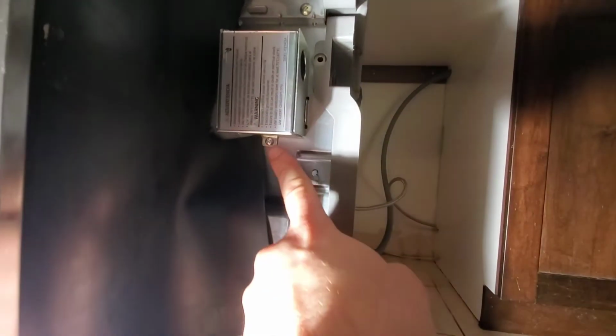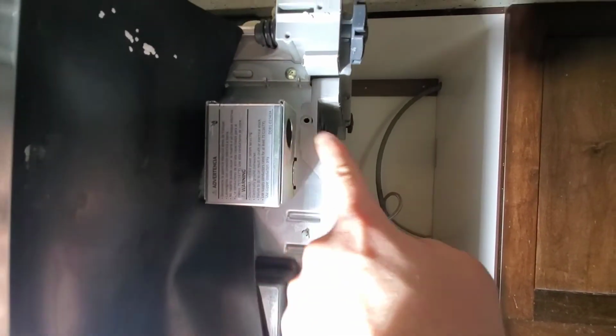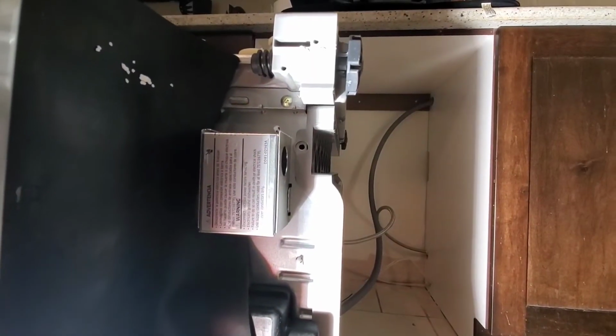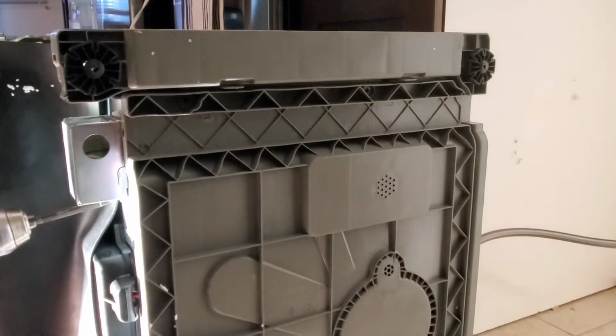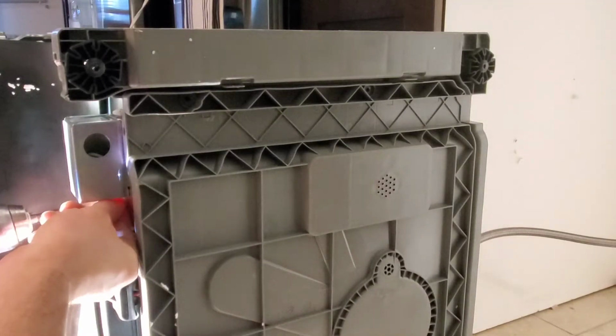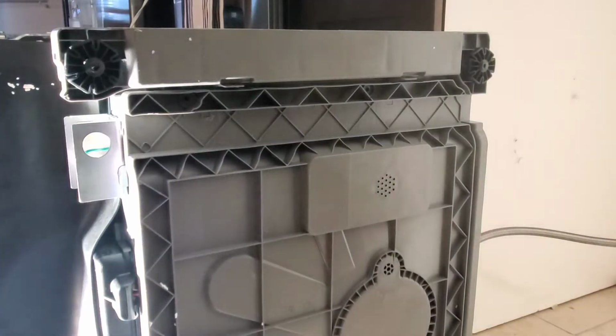So this is the power box on the new unit. There's a screw to the left. The hole is where the grommet will go. The channel is where the wire is going to go from the back of the unit to the very front. So I'm removing the screw to be able to remove the cover. It just clips on the opposite side of the bracket for the box itself.